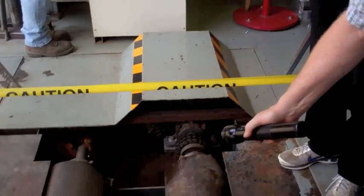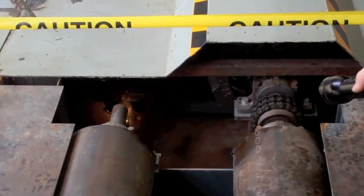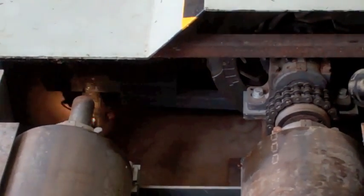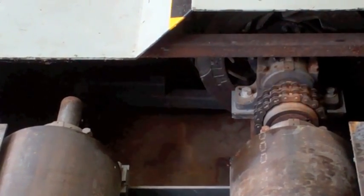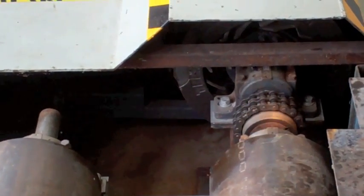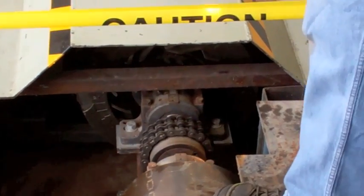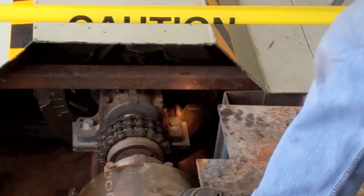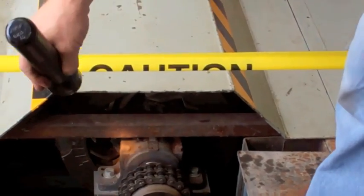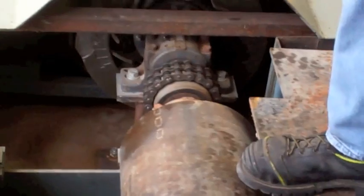Anyway, that gives you the torque right there. The load cell, multiplied by the distance from that pivot to the center of the shaft, gives you the torque. Does it pull up or push down? Pulls up. Now, on the other side of that bearing, there's a magnet and a sensor, which you can't see here, that gets the RPM.